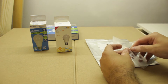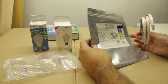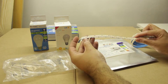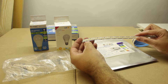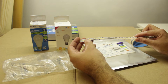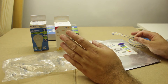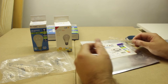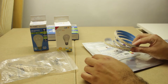They're easy to install, though I do have to use a power supply unit because these are not mains-rated. If you look at an LED strip, it just has LED chips and a resistor to limit the current. These come in two flavors, so the first thing to look at with LED strips is the voltage it needs and what kind of power it draws, so you know which power supply to get.